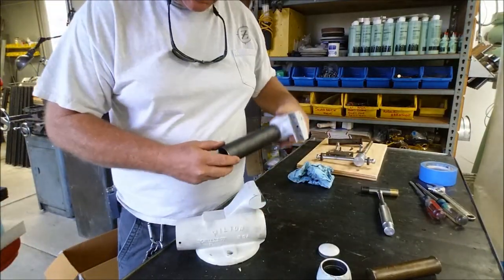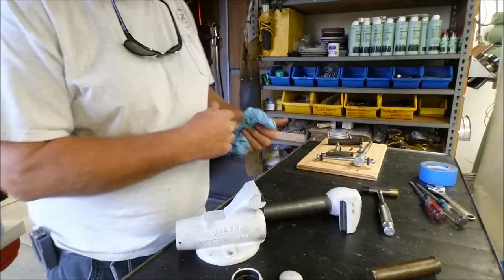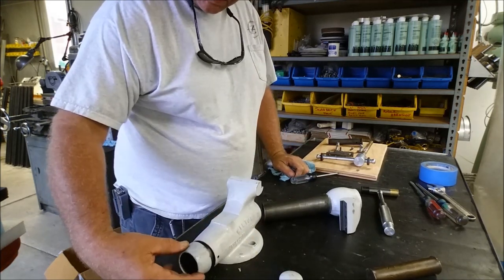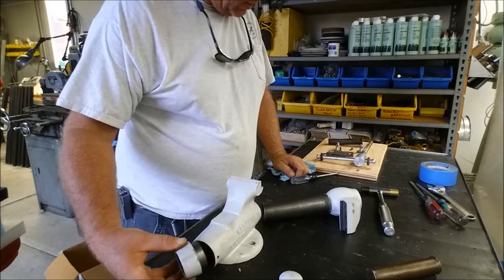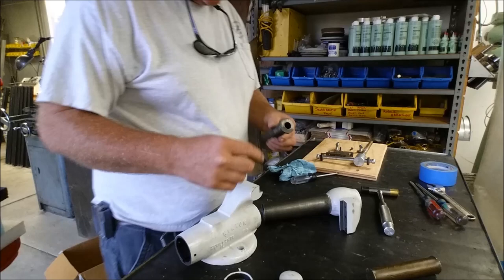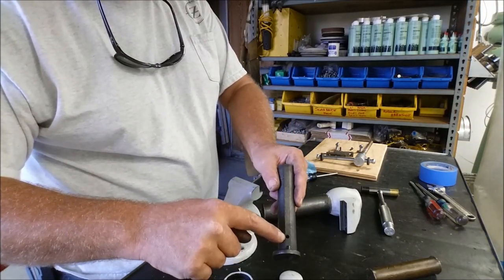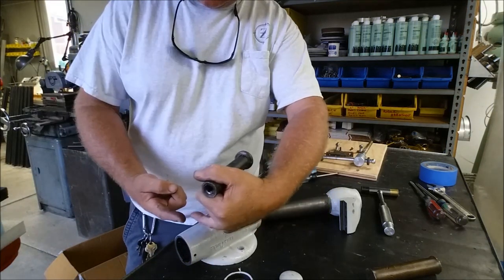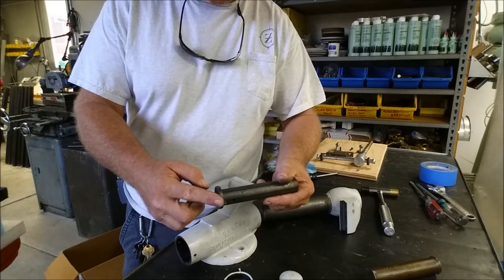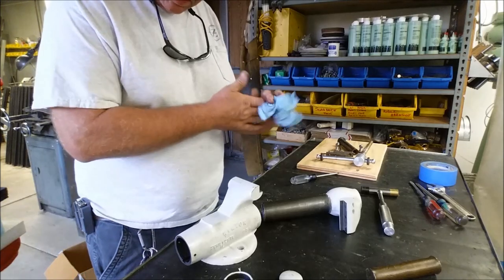So this is everything going to the powder coater here and there. Everything else stays and gets cleaned. So pretty simple, not too bad. I had to fight those pins a little bit to get them out. What you have to do is knock a pin in on each side here and here. And in Wilton's infinite wisdom, they gave us clearance holes in the nut here and here, so you can knock them in far enough and have enough clearance to get the cap off. So awesome, right? Okay, so thanks Tom for sending that over. We'll get it fixed up and out the door.